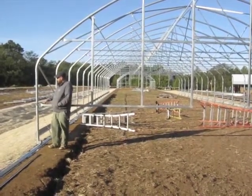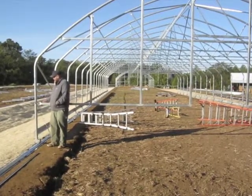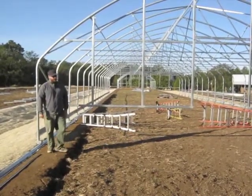The end wall itself installs to the sidewall hoop using one of the telescoping ends. And when we secure that in place, we need to make sure that no screws are anywhere on the outside surface, which will get in the way of where polycarbonate is going to go.